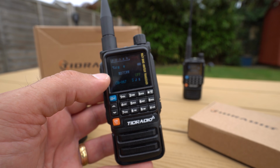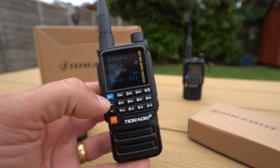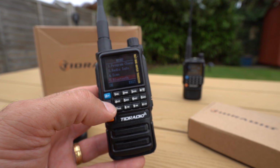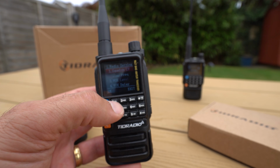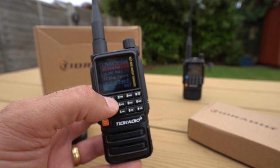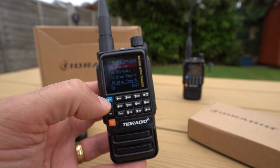And all the other stuff in there, like the name of the channel, channel number, and the other status on the radio there. So if we go back into there and go down to option 15 again. I don't know if you can actually jump straight to the menu. You can actually, by just keying in. If you know the option number you want, like 15 in this case, it jumps straight down if you just key 15 on the keypad, which is a good shortcut to know.